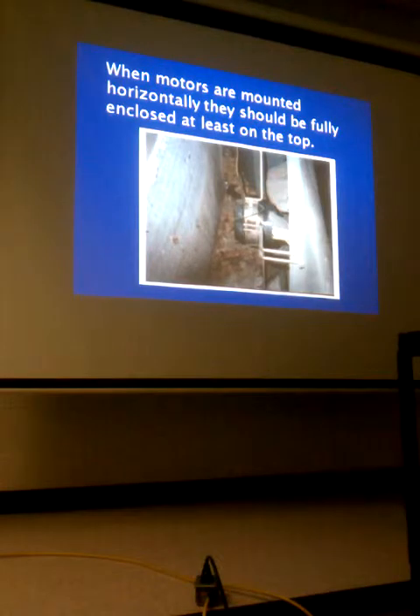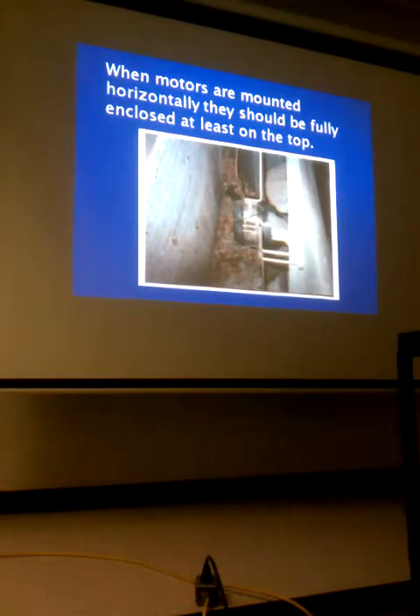What we did as a company, we chose to put a drop in them every year. We only oiled the outdoor fan motors in the spring when getting the unit ready for summer, and we only oiled the indoor motors in the fall. If bearings needed oil during a spring check, we'd do that, then hit it again in two years in the fall.